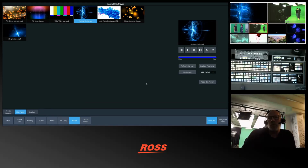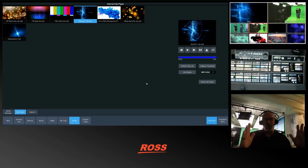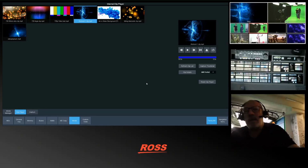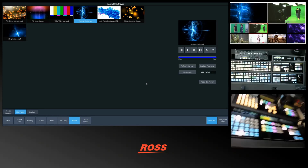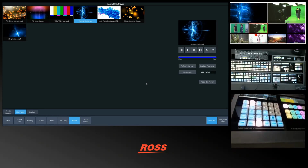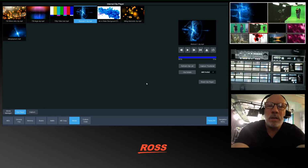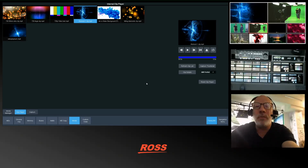Ranging from what's called a TD1C, the C being compact, and that is a desk that's 1 row, but it's been squashed, and it fits in a flight case or a rack unit. That's the idea behind that. The TD1 is a 1 row, TD2 obviously 2 rows. There's a theme, eh? And then the S part of it means that it's got a dedicated memory module. Not that any of the others can't recall memories, of course. It's just that it's got a dedicated module on the desk itself.